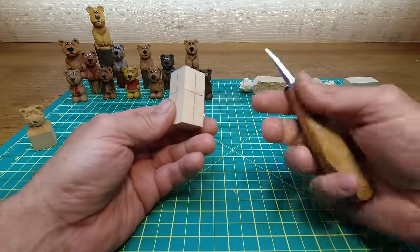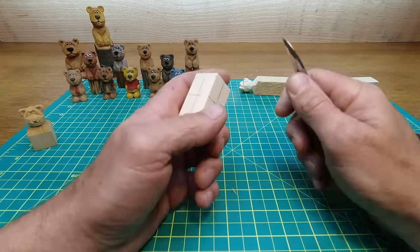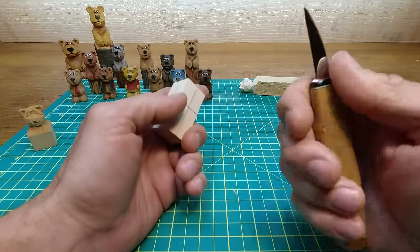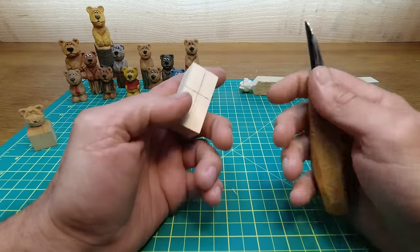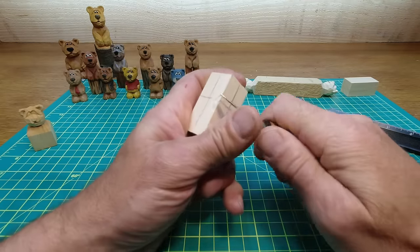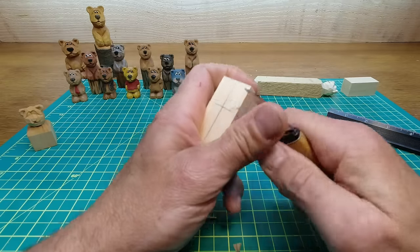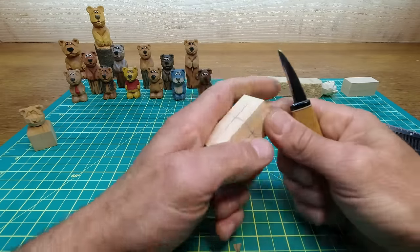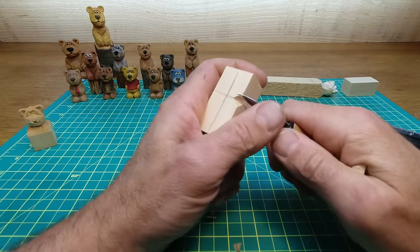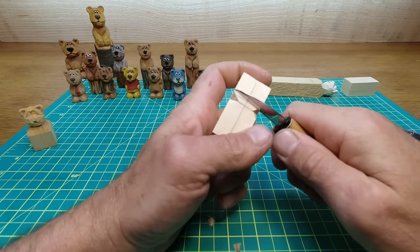I'm going to take my knife. Today's knife is the old faithful 1¾-inch Helvie, but any knife will do: Drake, Flex Cut, Badger State, Deep Hollow, you name it. Just a sharp knife, freshly stropped. Let's go, carving glove on. I'm going to go around at that 7/8 mark, and I'm just going to take all the corners off. That's just marking where the head's going to be, and then it'll be less wood to remove when I go across like this.